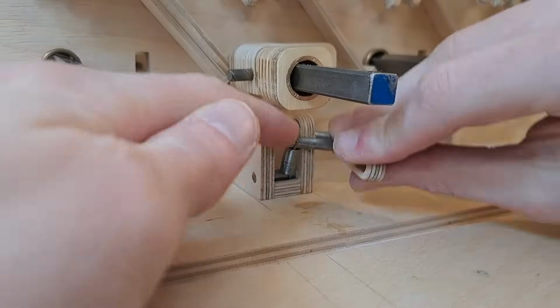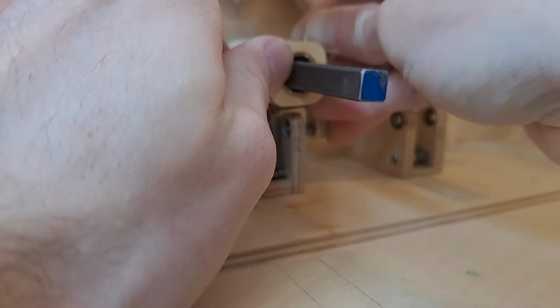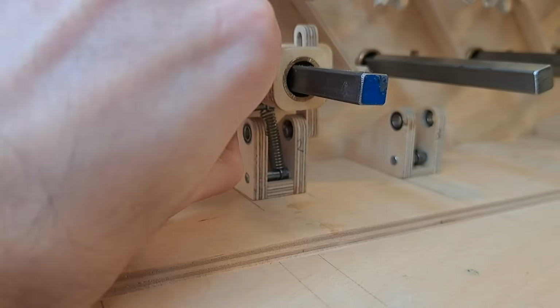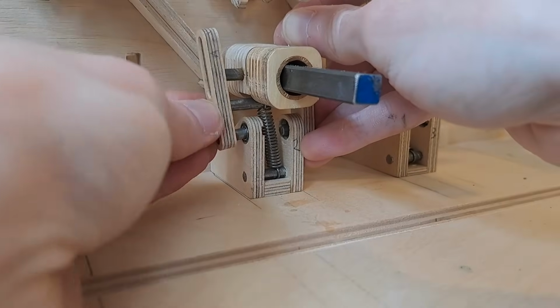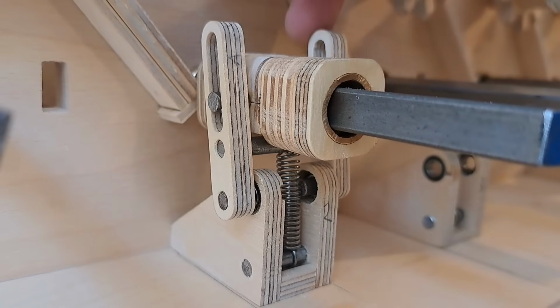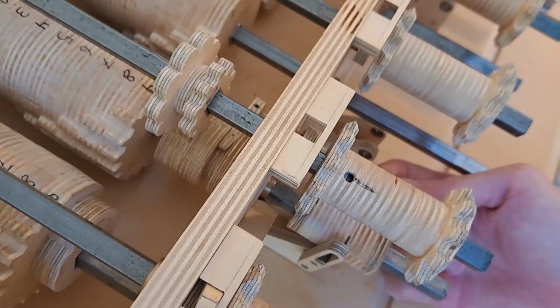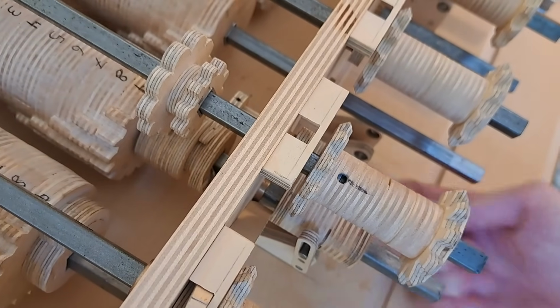The arms hold this shuttle that is attached to the extra tooth piece. This means that the assembly as a whole is sprung to want to be either all the way forward and under the gear, or all the way back and bypassing the gear. This gives the mechanism a self-policing tendency towards either definitely adding an extra 1 or definitely not adding an extra 1. It is binary, spring-driven to have no middle ground.